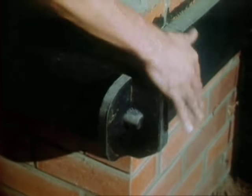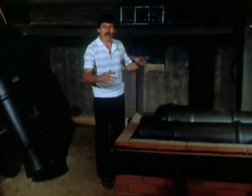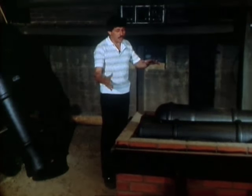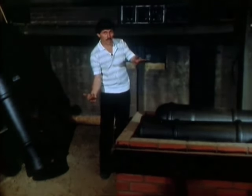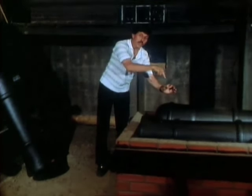The brick frames were held together by solid iron bands, and then the whole device was heated in order to harden the casting sand. After this had been done, the two halves were separated, the mock cannon was taken out, and through a small opening in the top here, molten metal was poured in.